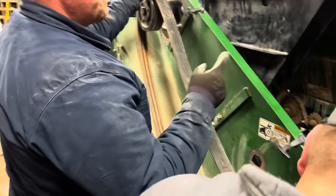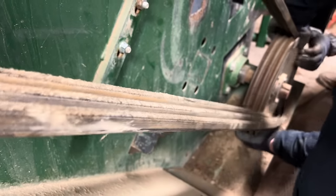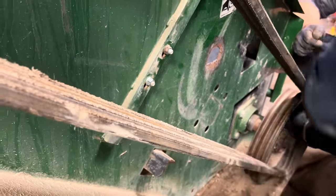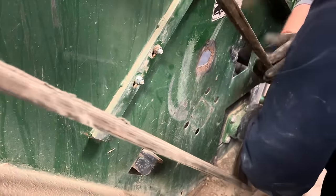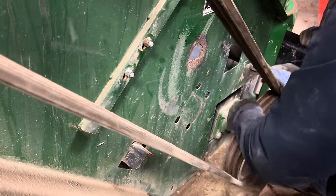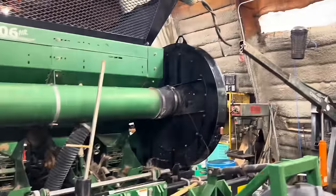Someone needs to hold the drive shaft — it sticks out the front. Just putting the belt on. It can be kind of a pain — this belt is just a hair too small, but we don't have to put the big stupid tightener in. We use a belt that's just a little too small and it works good. Now we've got the fan and everything all back together.